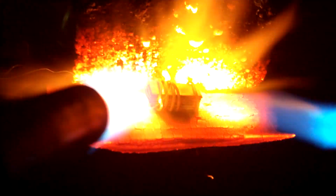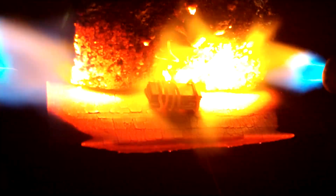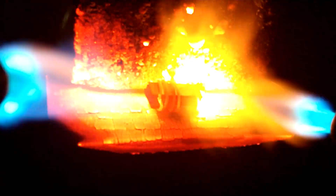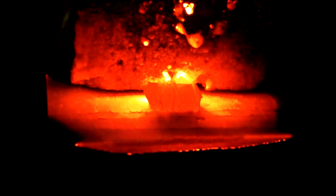What I'm looking for is a shiny metal surface — like mercury. I want the metal to run; it works just like solder. Shiny — fusion — that one's done. For some reason I don't like the way yellow gold comes out when it quenches, so we're going to let this one air cool.